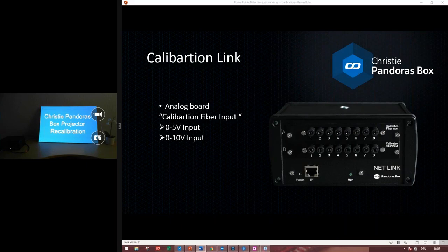Actually, these cards are analog input boards, and each board has 8 connectors. They detect the incoming voltage in specific gradual steps, providing data information from the connector sensor. In the software, we will get a value range from 0 to 1023 if light's coming in.